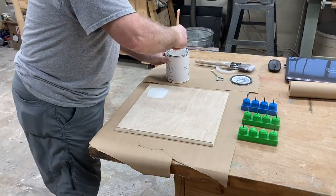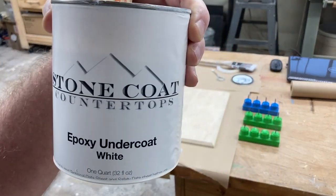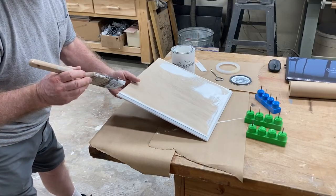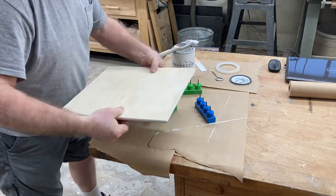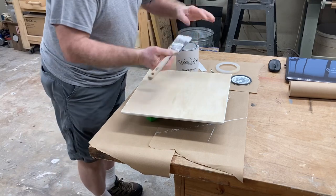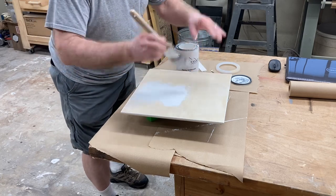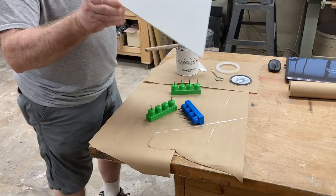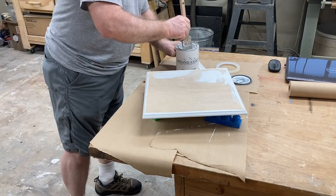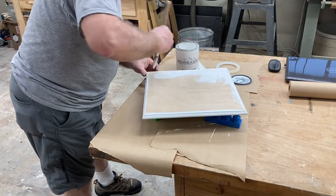It's time to put a primer on. The primer I'm using is a Stone Coat Epoxy undercoat in white, because I want a white background for this project. I'm putting two coats of this epoxy undercoat on there, painting both sides at the same time. Using a little standoff on the workbench lets me paint the back side now, then flip it over and paint the front side - that saves a step. Later, at the very end of the project, I'll come back and paint another coat on the back side. I may put a clear coat on the back side also.